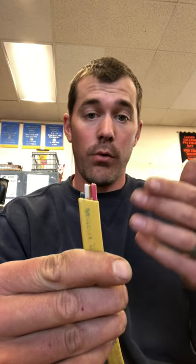What you would see in the next video are the different color codes for these different wires: black and red being designated as hot, white designated as neutral, and a ground being designated as either green or bare. You have to keep in mind these different colors because that will be helpful when it comes to putting together your different appliances. Based upon these color codes, you would never want to mix a hot wire with a neutral wire, as that would result in a short. Hot always stays with hot; neutrals always stay with neutrals.